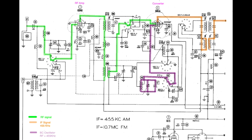So that goes down through here, goes through another capacitor inductor pair, an LC network, gets magnetically coupled to another LC network. So how many have we seen here just for the AM path? And this is one too, I'll talk about that in a second. But we see one right here, we see one here, we see one down here for sure. We see one over here, this pair is our first IF transformer. Here's the other half of the first IF transformer, and it goes on over and onto the next schematic, which we'll look at right now. Here's the right half of the schematic.